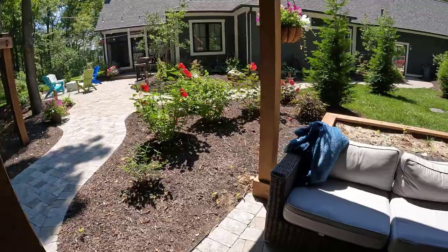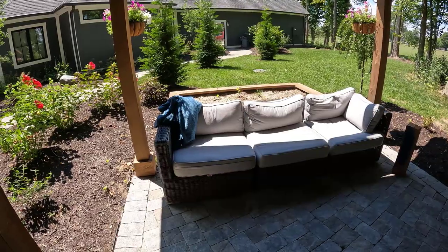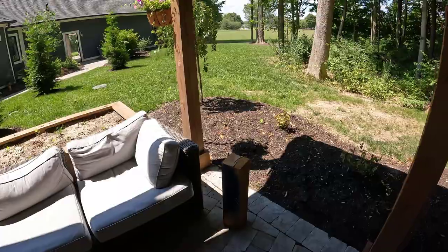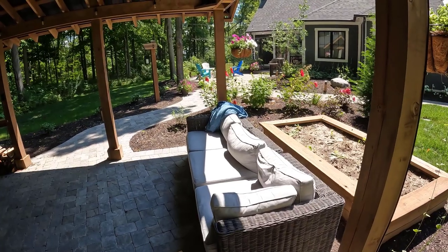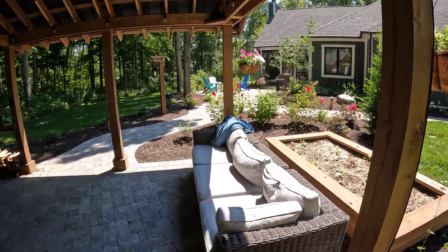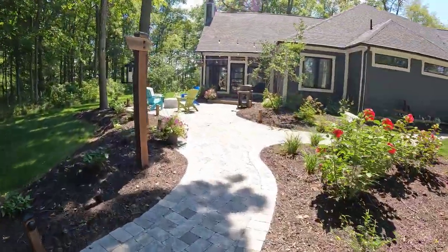What I wanna do is build two end tables, one on each side of the couch. I think they're gonna be roughly 20 inches by 16 inches, both of them. I'm gonna make them out of 2x4 material, pine, just regular stud grade pine. The reason why I'm doing that is because I'm gonna stain them black. So I'll have a little bit of transparency with the stain, but not much. I want them black because I think it'll match the outfit of the room pretty well, and it'll match the couch well too. Let's go get the saws out. Let's get to work.